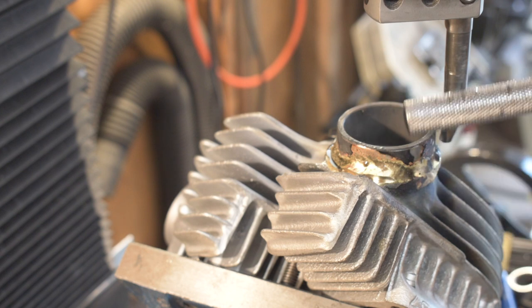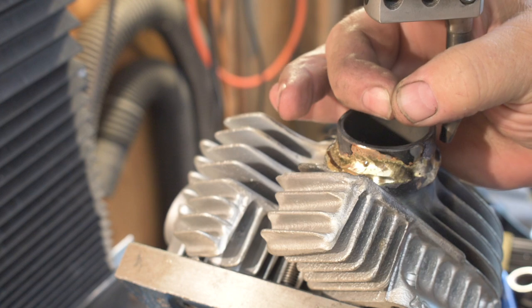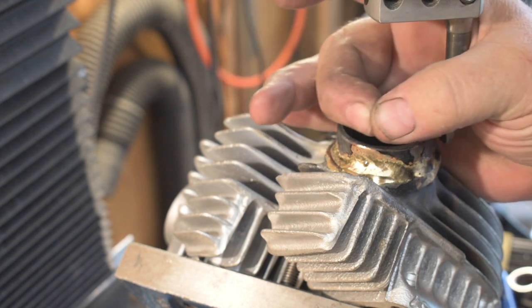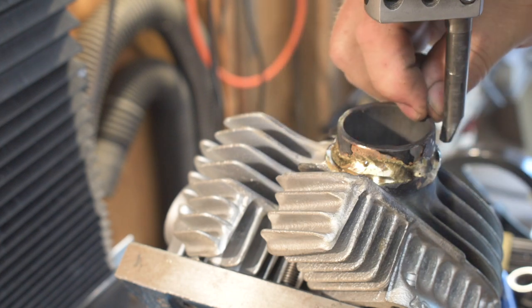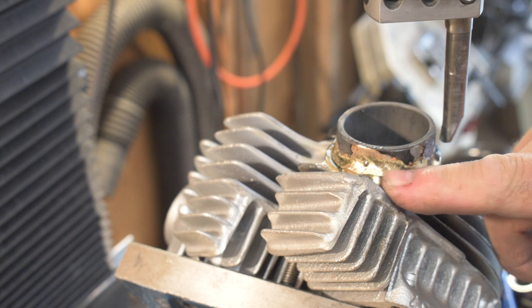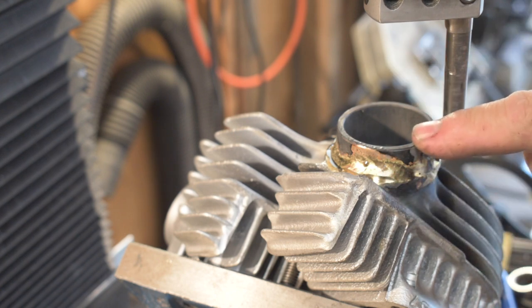Anyway, this had a chunk broken out of it. And the reason the chunk was broken out of it is because when Harley bored the hole for the exhaust, they didn't center it very well over the port. So one side was real fat and one side was real thin. Well, this thin side broke off. So the repair on that ends up being cutting the spigot off, which I've already done, machining a new spigot